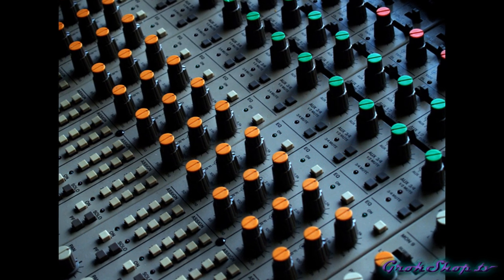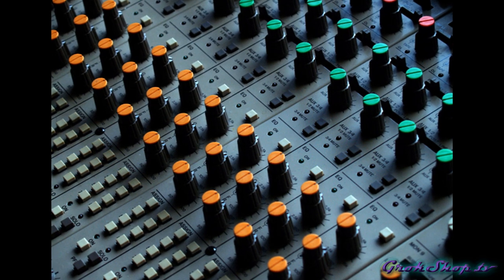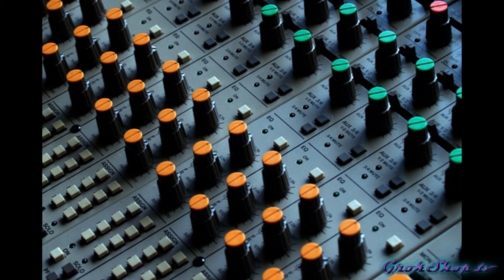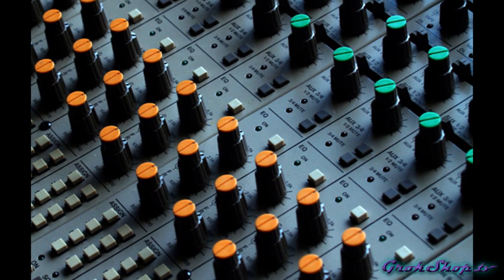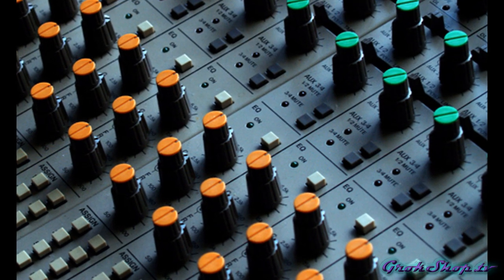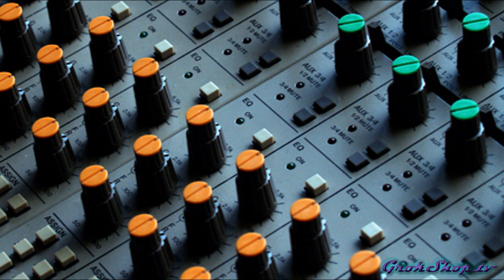One last note on general engineering troubleshooting: I've given you a lot of points here, and when you go to troubleshoot your system, make one change at a time — turn one knob at a time. Note the effect, put it back, then move on to the next change. You might want to let it run for a day or two for each change to make sure it didn't have any negative effect, since sometimes issues can take a while to surface. Then go back and apply all the changes that had a positive effect. You'll learn more about what each thing does, and that information will help you when you move on to your next router. That's all for today — thanks for watching.